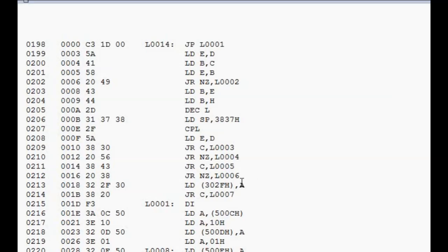So once I'd read the ROMs, I put them all together into a single file, and I tried running them through various disassemblers. One of the issues with the code in this particular system is it's dotted with quite a large number of text strings, but also a large number of lookup tables. If you're aware of how disassemblers work, you'll know that they're very poor when it comes to dealing with those things. So I ran I think three or four different disassemblers, and ended up having to write one specifically for this that would do a reasonable job of skipping over the text strings and lookup tables.